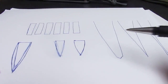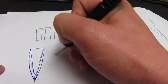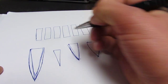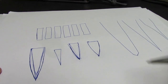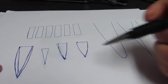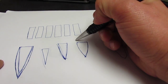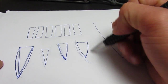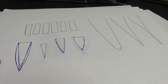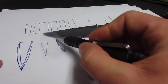In fact, there's a lot of straight razors. They're called wedges. And they actually are zero ground, flat, like that. What's the disadvantage? When you go to sharpen them, you have to sharpen this whole side away. What's the disadvantage of a convex edge? If you want to sharpen it properly, there's a lot of ways to cheat, but you have to take off all this on the side. So that's why I'm saying everyday use, hollow grind wins for me. There's not much area to sharpen here.